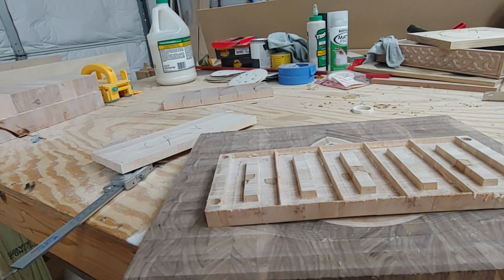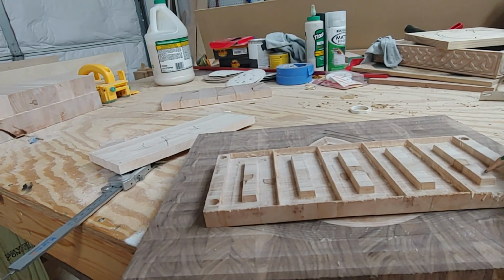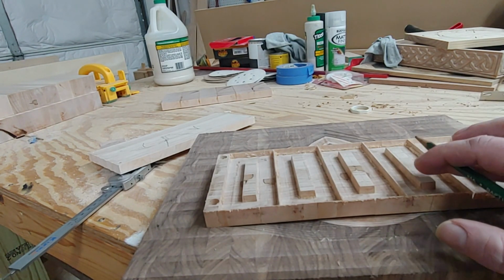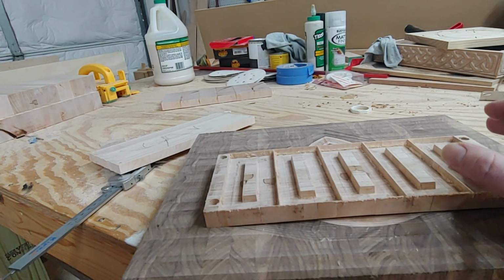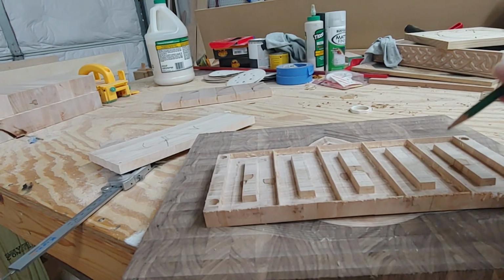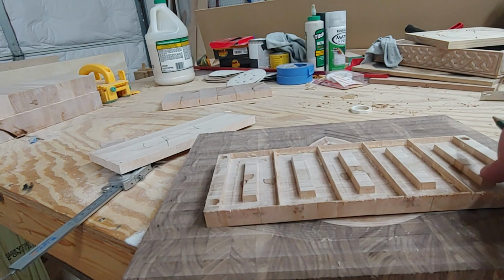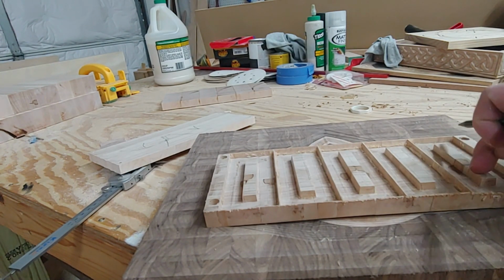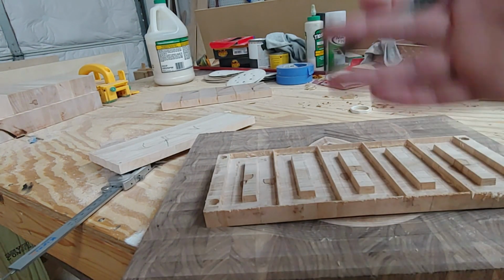So I'm going to be changing, instead of doing a start depth of 20, I'm going to do maybe a start depth of 24 and a max cut of 0.1, or maybe even a start depth of 24.5 and a max depth of 0.05, so that I can get it as close to a reverse cut as possible. But I'm worried that if I make it too close, then I'll have the floor of it mashing into the cutting board or my piece.